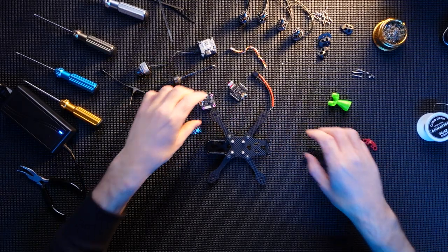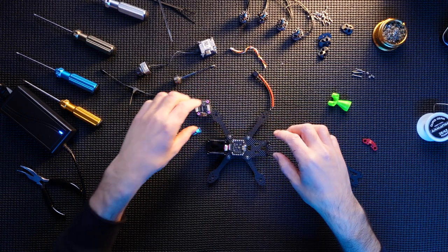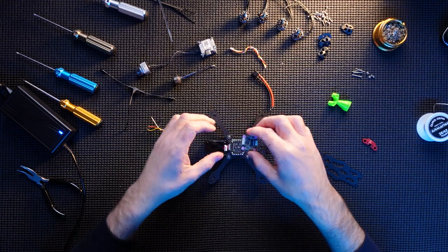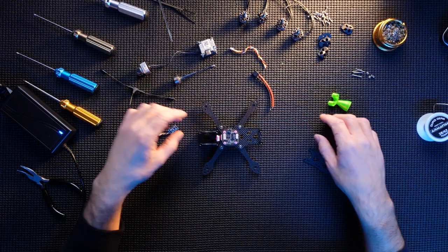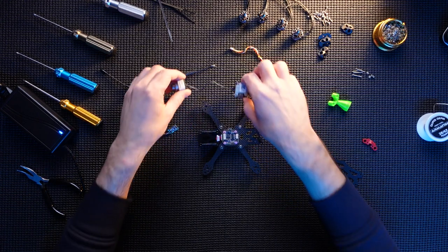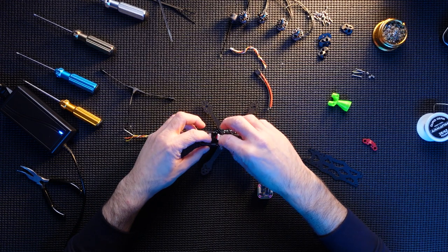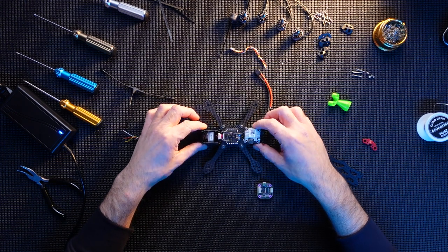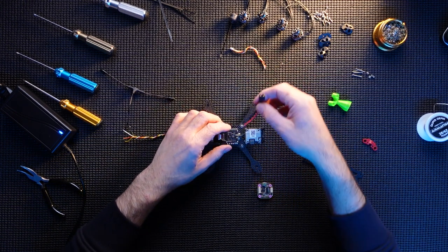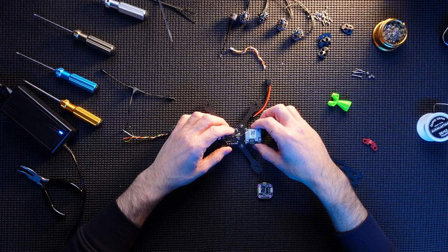That goes in there, obviously. Get the stack in first of all. Obviously put it in the right way. There's an arrow always on the stacks. Arrow goes towards the front. Caddx Vista is going to sit there. And instantly, you know that is going to have to sit under. That's going to fit there, no problems. Ample of wire, ample of cable. You can already see it might get a little bit snug with the battery connections in place, but we'll come across that. I may need to raise this up on a couple of gummies, but that'll be no problem to do.